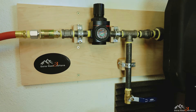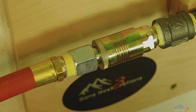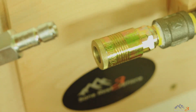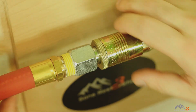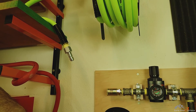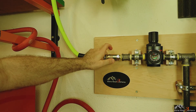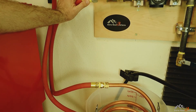After the regulator comes another three-inch nipple and then a female-to-female coupler, before ending this section with a Milton G-style coupler. I highly recommend these quick connect couplers — they allow you to stay at half-inch diameter and are extremely high flow, allowing 99 cubic feet per minute of airflow. A fellow YouTuber did a good summary on these couplers so I'll put a link in the description. I ended this first section with a Milton coupler so that I can either attach my 50-foot half-inch air hose right here for tires or a brad nailer, or connect through my homemade air dryer to the next hard line assembly feeding my sandblasting cabinet and powder coating setup.